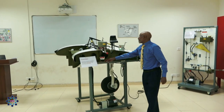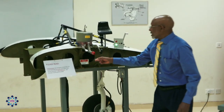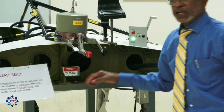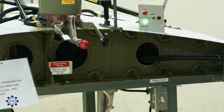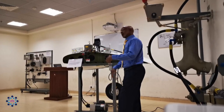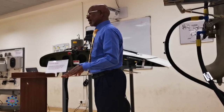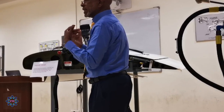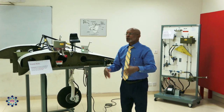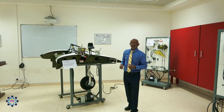The other case is the emergency extension. This is an emergency extension handle. If we pull this handle, what will happen is we release the pressure on the other side. As soon as we release the pressure, it will go down by itself. As we all know, this is our panel, but in the aircraft itself, due to the wind, after the landing gear goes down by gravity, the wind and drag will push it to the locked position.